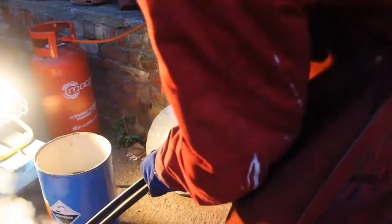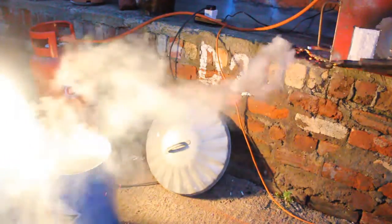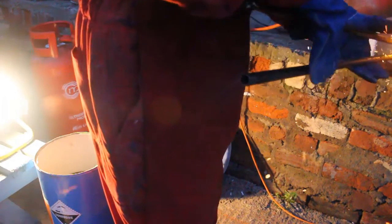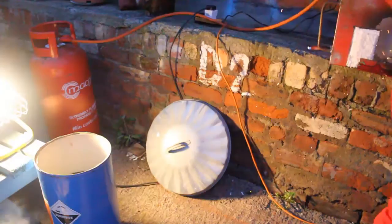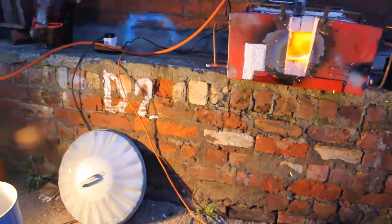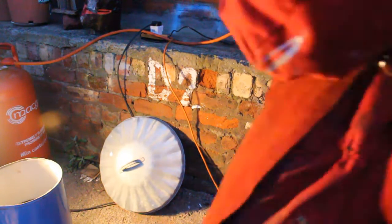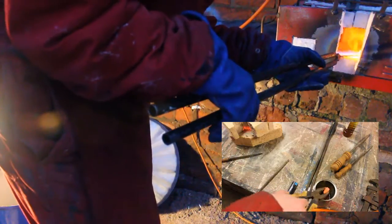Allowing the metal to cool again, I heat the metal back up to critical temperature to quench harden it in oil. During tests, I used linseed oil, but after watching Last Frontier Knives' video, I got some black used engine oil to add even more carbon back into the blade. At first I only dip the hot metal in quickly and return it to the heat as described in the linked video, before finally quenching.